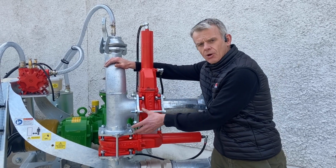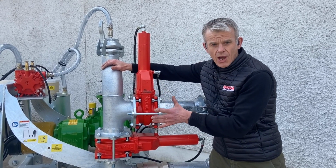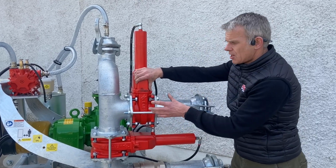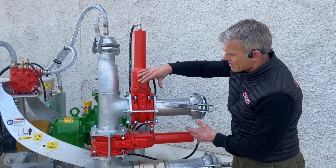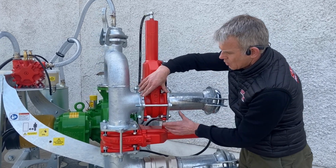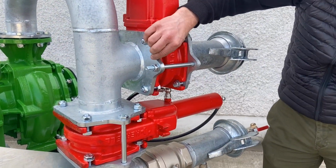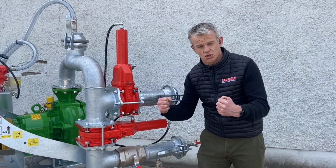Now you're probably not going to close these when under full pressure, but it depends on who's on that seat and what happens on the day. So we're trying to build a bit of safety in with valves that are rated to do the job properly. The other thing that we are doing is these valves are sandwiched not just with the normal 4-bolt positioning. We've got 2 bolts on either side, so we're pulling these really thick, and they're running about 12mm profiles together. So we're trying to build something that's strong.